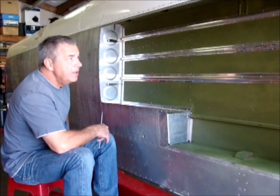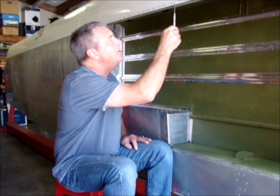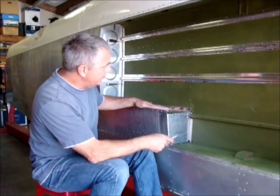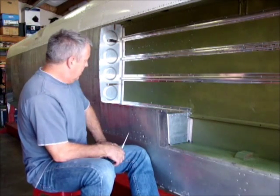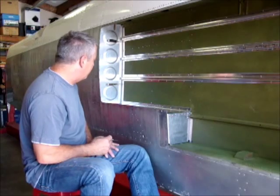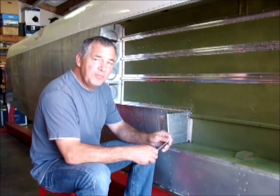It's looking good and I'm really enjoying putting this together. As I was looking at this, I realized this wing is actually probably stronger now than it was with the old tank — especially with all the extra rivets in between the nut plates on the leading edge, which transfers the stresses of the skin to the spar. The new intercostal, the stub rib, the shortened rib, and a couple of old holes for nut plates all contribute. You can take those nut plates off the old rib — you don't need the two down here — and transfer them over to the stub rib. Secure the skin to the intercostal, get your nut plates found on the back side, get your new hat section shot on, fill in the other holes that used to be stringers and rib holes, and then we'll close this up and start putting the tank in.